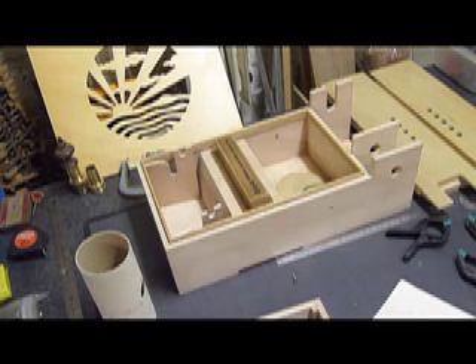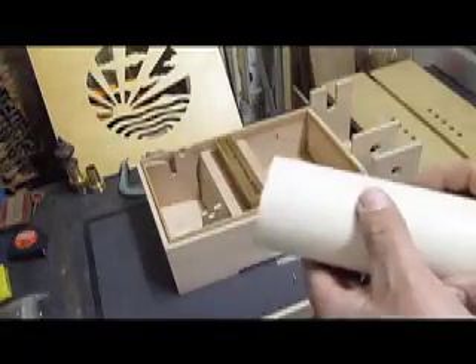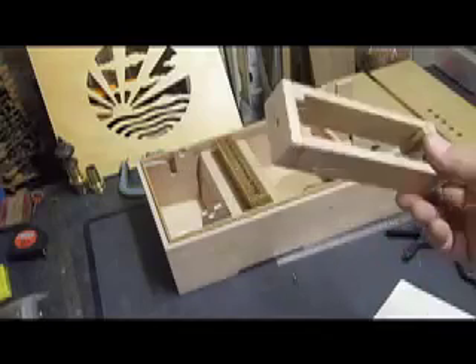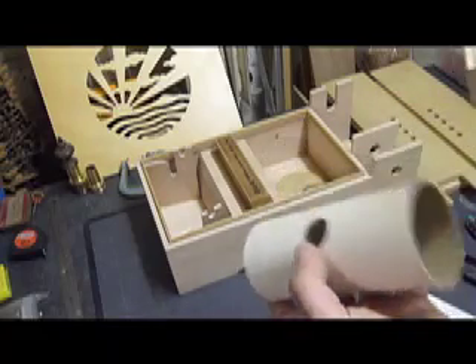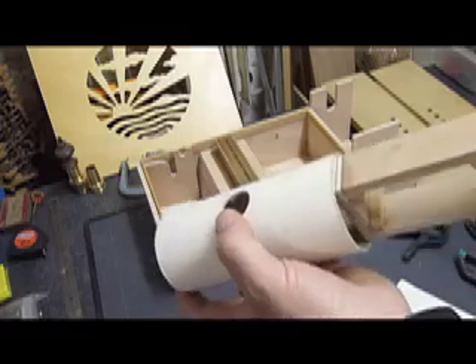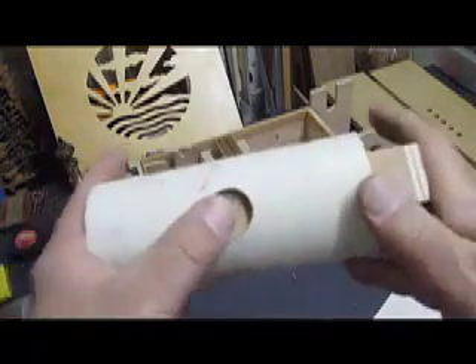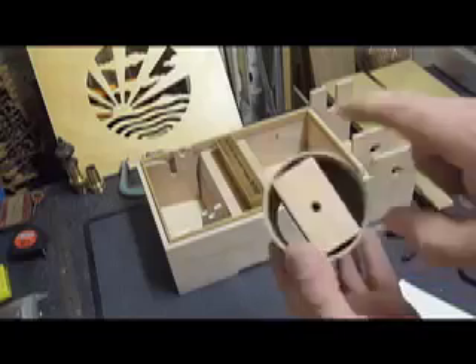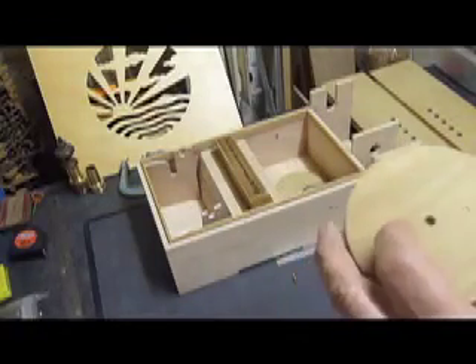I've been working on the spool, and again I thought it would be the simplest thing to make, but actually it's got to be made very accurately so it runs straight inside the organ — so it took me a bit of time yesterday afternoon to make and think about. I made a little wooden frame out of ply that's been carefully drilled on a very straight axis, and a bit of cardboard roll. This wooden frame is going to slide into the cardboard tube — it's a tight but nice fit, with nothing being forced or stretched, and the tube keeps its round shape.